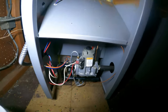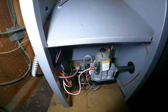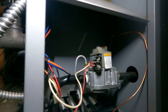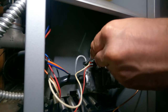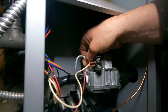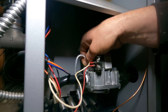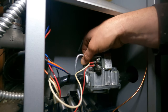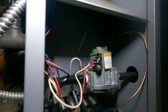What you need to pull it out is a 3/8 for the thermocouple, 7/16 for the larger. You can use flare wrenches if you want. So I'm gonna first start right here, loosening the fitting. And usually they're very easy to loosen. Sometimes they're not, but usually they are, unless somebody cross-threaded or really decided to go overboard with it. It should relatively loosen up with no resistance.